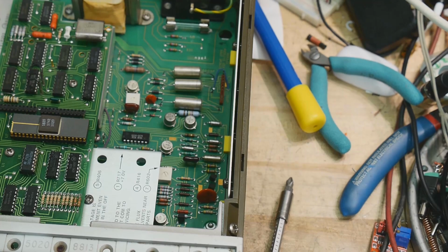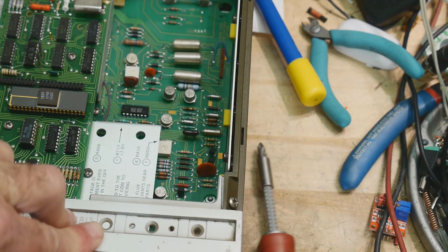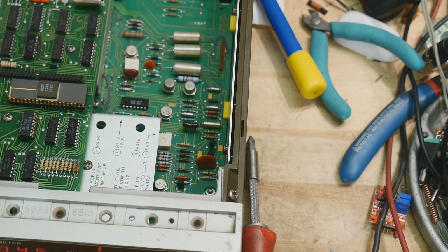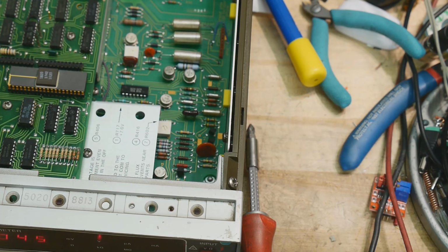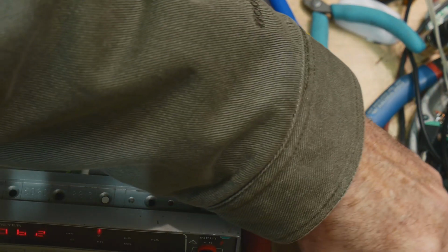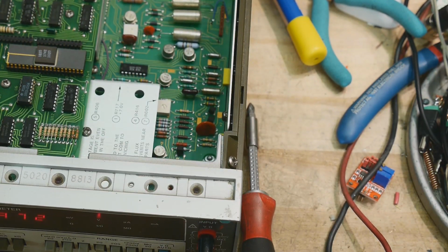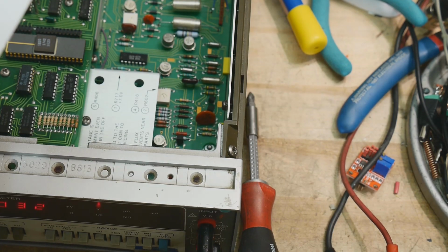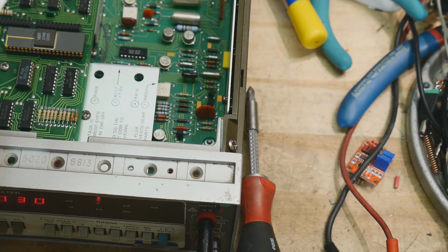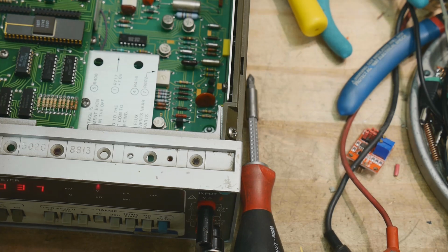And now we need to get it into the instrument. So. We are measuring a little low, 18.9. All right, and we're inputting 19.1 right now. All right, so 19 volts, adjust R102.